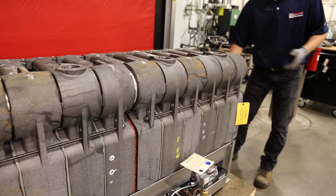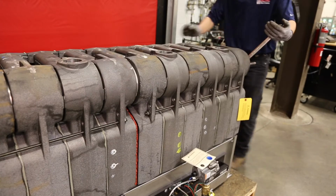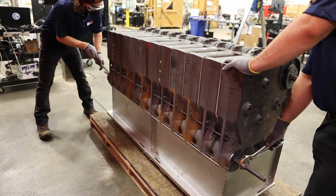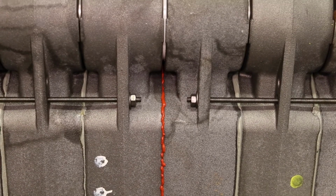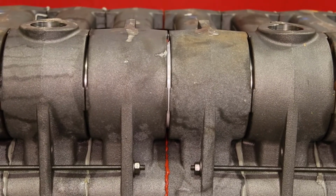Continue tightening until the section assemblies meet iron to iron. A small gap, typically less than 1/16 of an inch between the sections after assembly, is normal. Note, do not remove or loosen draw rods at this stage. They will be removed at the end of the assembly procedure.